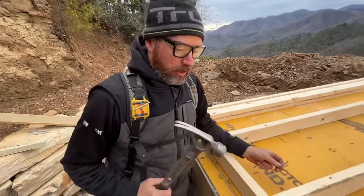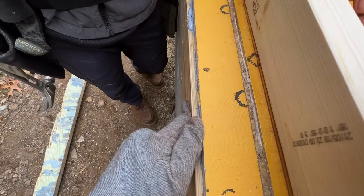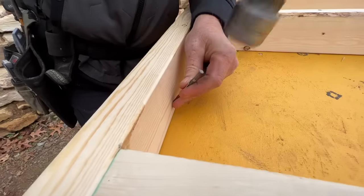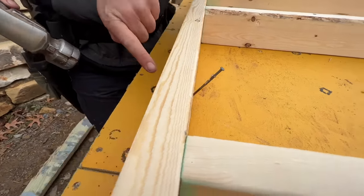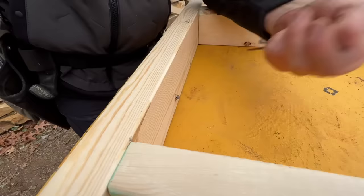You can see our chalk line that's three and a half inches in from the framing. Be careful because this plywood's in a little bit — make sure you measure from the actual outside of the framing. Then do a toenail at a steep angle so we don't pop out the other side. Leave the head out so we can pull it once the wall is stood. I'll do that about every two feet down the wall.